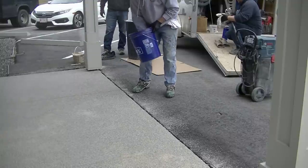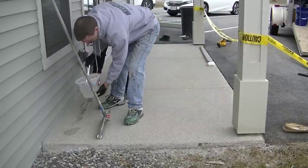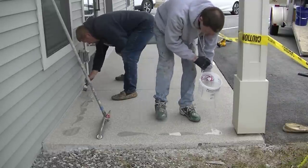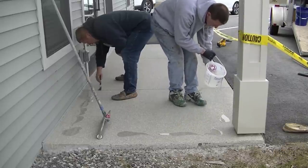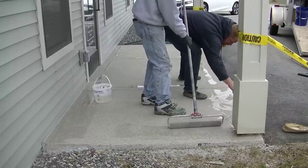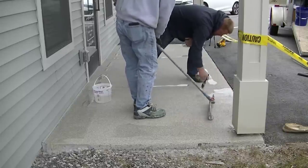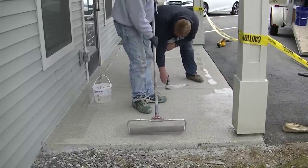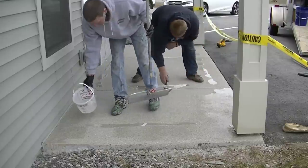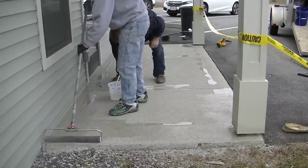This resurfacing material dries in about an hour, then we can keep going with the finishing process. We got it all scraped, sanded, and vacuumed off the excess flake. Now we're putting a clear polyaspartic topcoat over it — this protects it, waterproofs it, and keeps any water or moisture from sinking into the concrete. Right at the very end, I'm going to broadcast a non-slip aggregate onto the surface to keep it from being slippery.